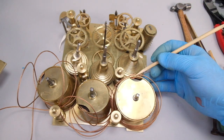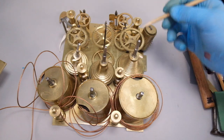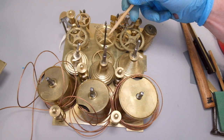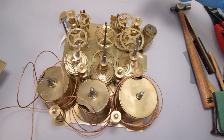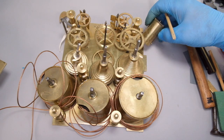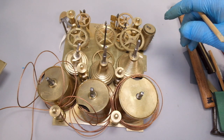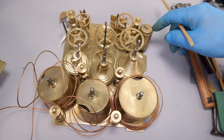Here are our three trains, and it's a good opportunity to take some photographs if you're not confident of where they go. Because this clock is handmade, nothing really can be interchanged. I notice that third wheel there is finished very differently, so that's something I'm going to want to investigate. It always worries me when I see that kind of annular refinishing of the entire mobile. We'll see as we go along.